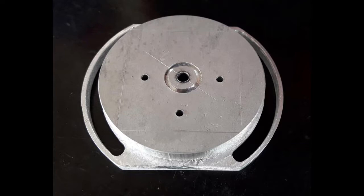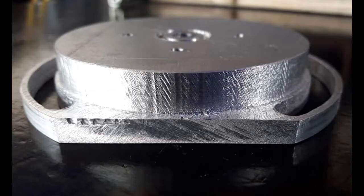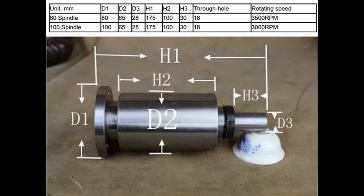This quick change tool post came from them as well — it was cheap and pretty bloody nasty. You may have seen this in my opening video, Episode 1; it was made to mount the compound slide and proved pretty damn useless in the end, and got replaced later. The spindle I bought from AliExpress because the same thing on Lazada was about twice the price. It's very well made, well and truly inside the specifications. I ordered the 125 millimeter, or 5-inch, version which is made to order and took a bit longer, but I'm glad I did — a 4-inch would have been too small and the 5-inch chuck is working out pretty well.